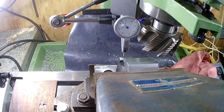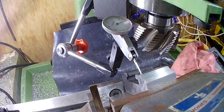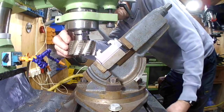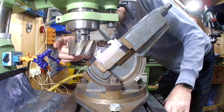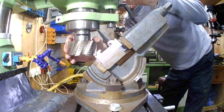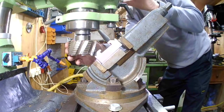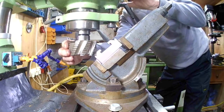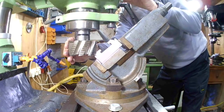The trick is to fit the cutter to be used in place and secure it. Put the milling machine into neutral so the cutter can be freely rotated, and maneuver the tool holder using the hand wheels, gently rotating the cutter against the tool holder in both the vertical and horizontal planes. Care is to be taken not to mark the faces any more than is absolutely necessary. When you're happy with that, lock the Y slide and use the hand wheel to move the X slide so the tool moves out of the way, then engage the gears again.